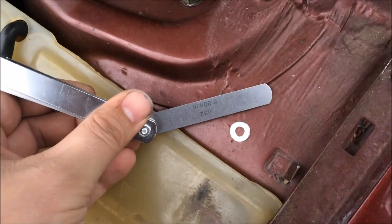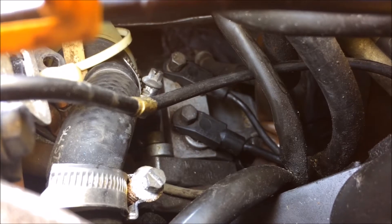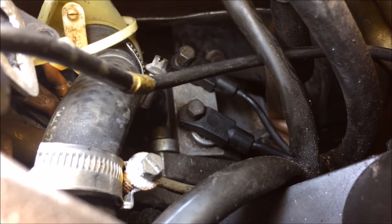So that way we can find a washer that is 0.8 of a millimeter. The first thing we're going to be doing is taking a piece of tape and putting it over the hole in our bell housing. It is kind of hard to see here, but I do have tape over my OT hole there — it's just to the left of the reference sensor bracket.